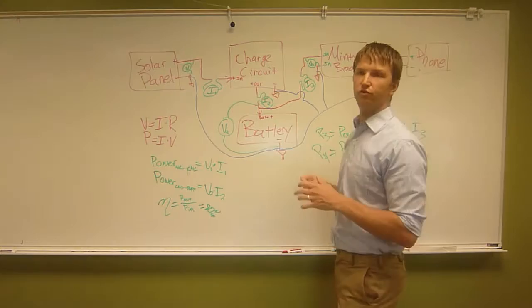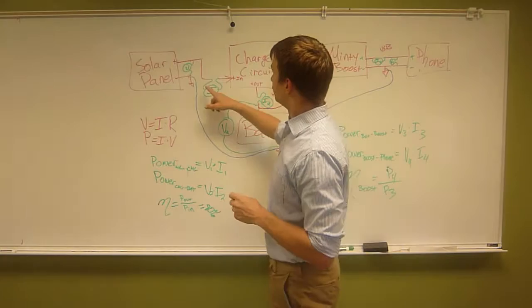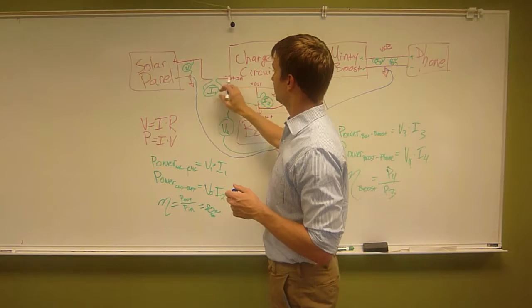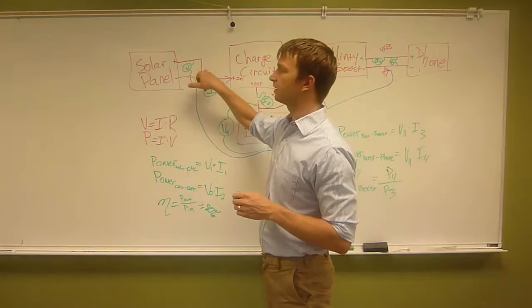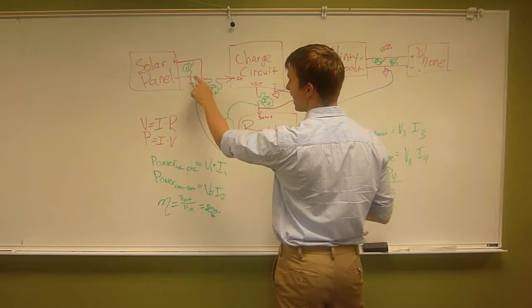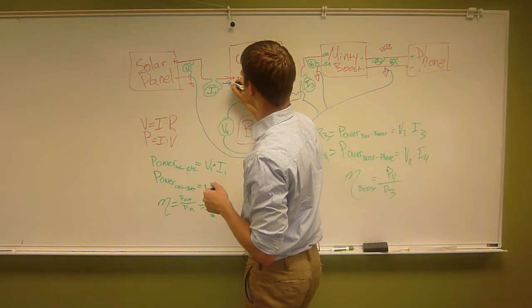For instance, you have a solar panel that plugs right into your battery charger. So both of these will plug in to this. There's a plug that has both positive and negative, and that already inside here connects this negative to this negative. But you'd still need to cut it up though, right? You'll still need to cut the positive one up, but you won't need to add a wire. This blue wire right here, you won't need, because its connector has both of these minus in.